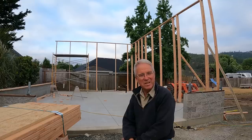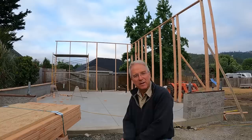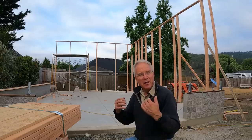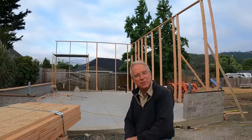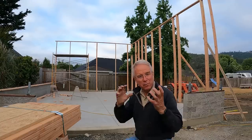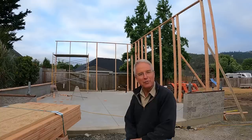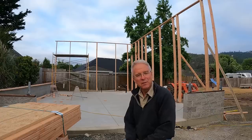I've got about 10 hours, I think, in the lumber that you see on the ground and in the air back here. Now that's a long time, but I'm one man. And so I'm just kind of thankful to have these walls up and have a system going. The first short day was spent putting the plates down and detailing and drilling the holes and all of that. Tedious, slow. And then the second day, yesterday as it turns out, was spent implementing a system I'd been trying to figure out for weeks, thinking about how to get 16-foot walls up one piece at a time by myself. Turned out it worked. Should get it pretty well wrapped up by the end of the day today.